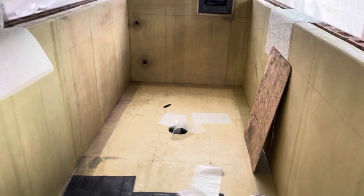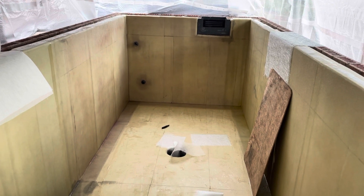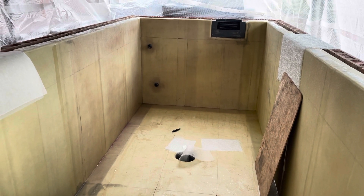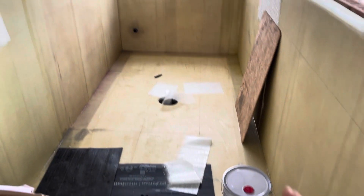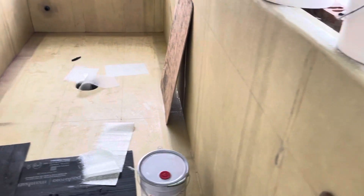Maybe it was made in a different factory somewhere in the world, I don't know. But the batch has been tested apparently, confirming what I already knew: that the pot life - how long it lasts in the bucket - is shorter than normal. And it's not just shorter, it's half the time. I've spoken to the supplier about this and it has been noted by other GRP guys. Others have noticed it, hence them supposedly sending it back and having the batch tested. So I said I'm not going to be using any more of this resin because it's not giving me enough time. This was never a race to see how fast I can fiberglass - it's about having enough time to get a nice flat finish.